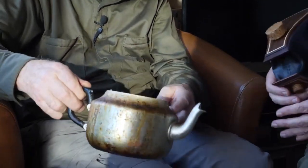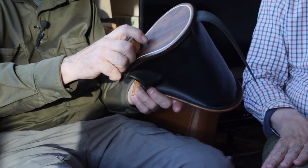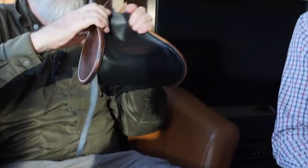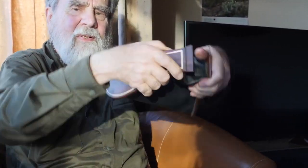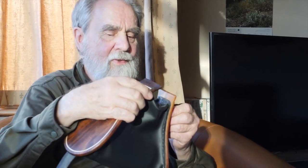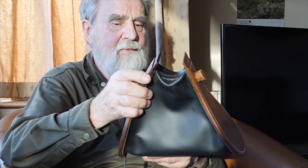And so then what do you do? You've got it in here. You've heated it up. Pour an excess of this stuff into here. Put the corks in. Well, leave that cork in. Pour it in there. Stick that cork in. Give it a good shake, always like that, and then pour out the excess. Usually about 60 or 70 grams of gunk will stay inside. It's surprising how much, because it's got to coat everything inside.